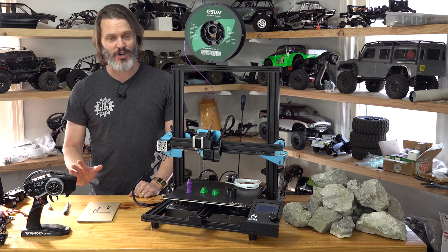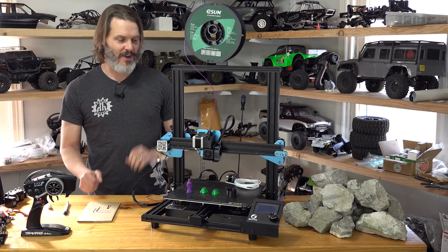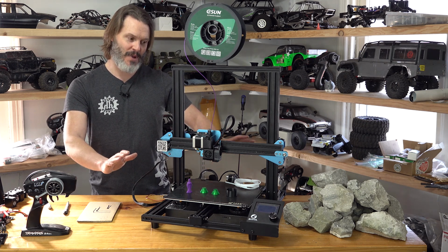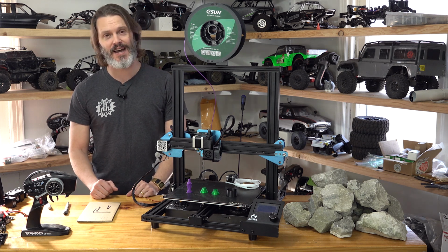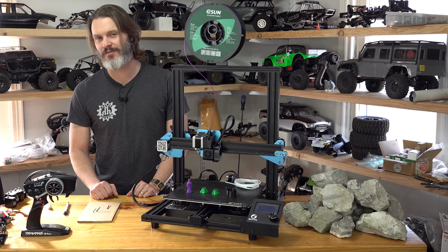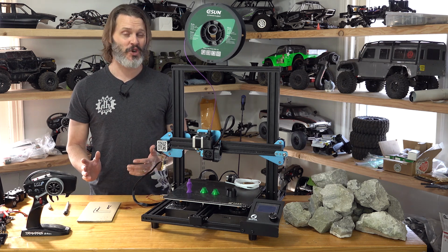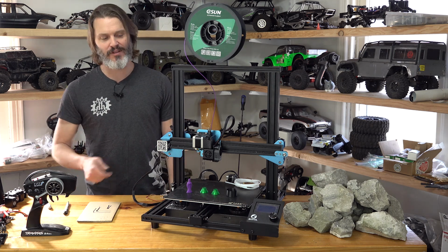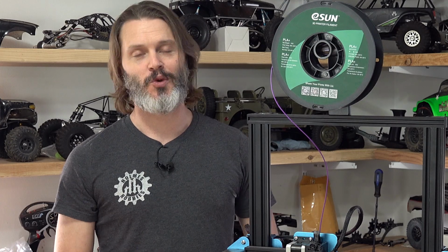But again, it's one big retraction test, and TPU is just as stringy as it gets. And if I'm going to print a whole tray of them and it has strings all over it, I'm not even going to sell them. I'm not even going to try to clean that up. It is not worth my time, especially when we're selling 10 of them for $5. I could spend well over 50 cents of my own time just cleaning up strings. On top of that, it doesn't look good because you have blobs where it's strung from. Even if I hit it with a heat gun, it would blob onto itself. It'd just be ugly. And a scale cone, if it's going to be ugly, I am not going to sell it.